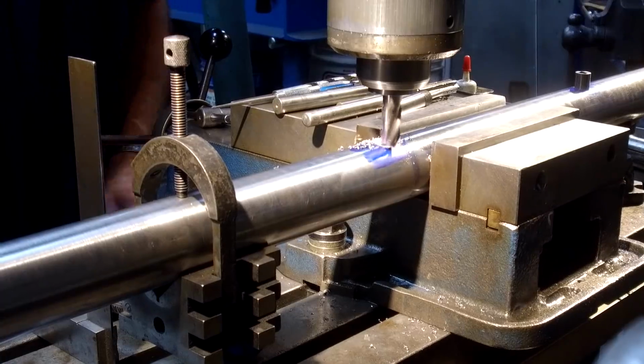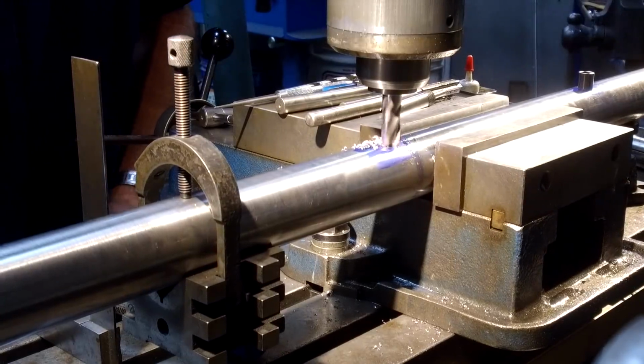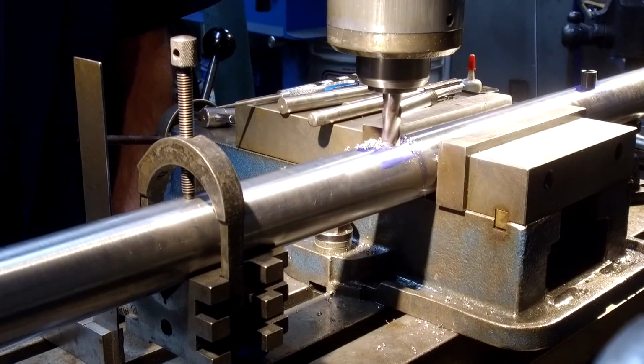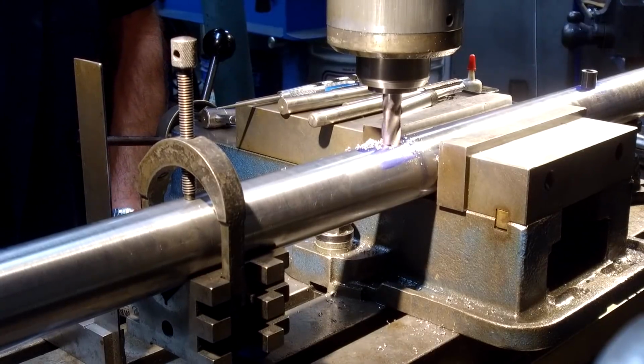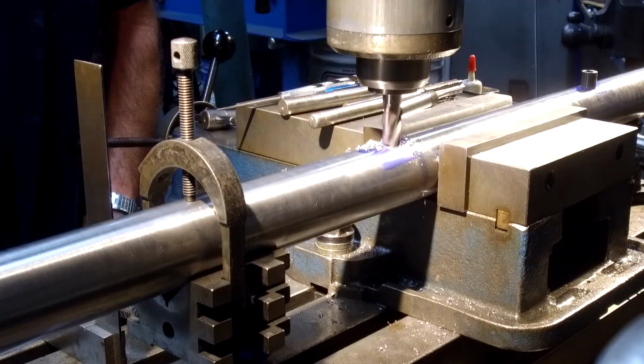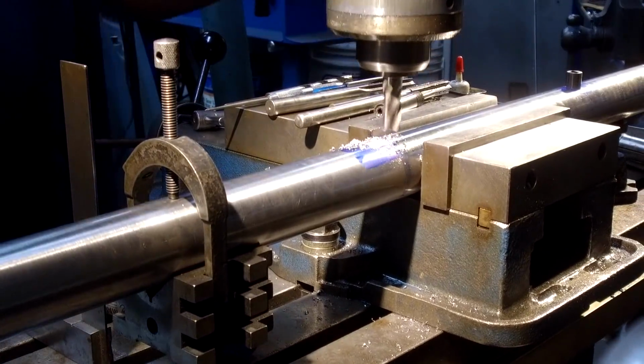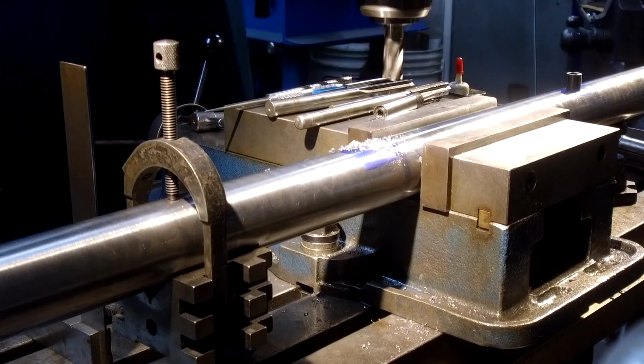And that looks like we'll have about a 1/2 inch or a little bit better landing right there. And it doesn't hurt to have a little bit, because we're going to round that surface off after we put that sleeve in there anyway. All right, 775. Okay, right there.